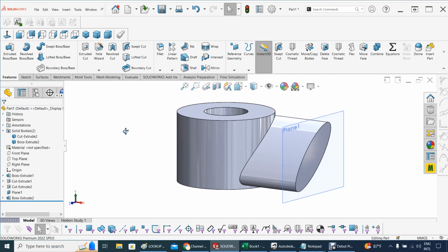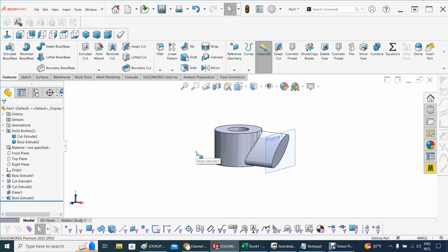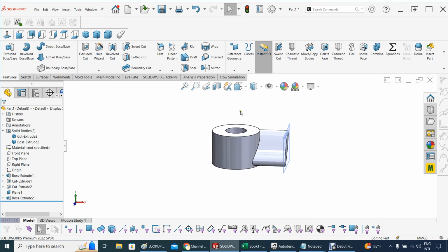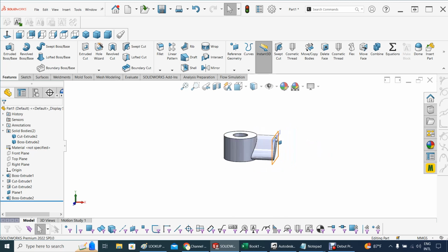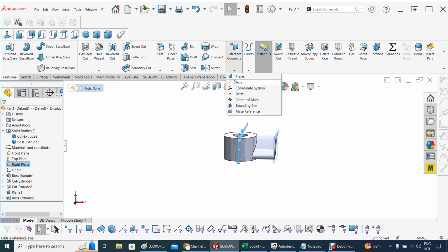Now, here's the story. I want, from the center here at half of the distance, I might drop a little bit, from 45 to 30 degrees, and then the other half end up in about 15 degrees from this one that is 45 degrees. So in other words, the root is at the highest angle of attack, which is 45 degrees. But as I go along, I reduce it a little bit. In this case, what's going to be the reference? Now, the reference there, reference plane.